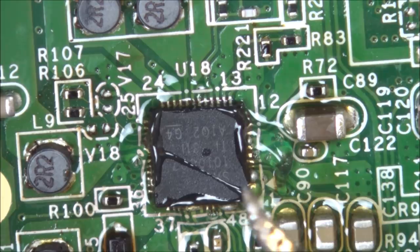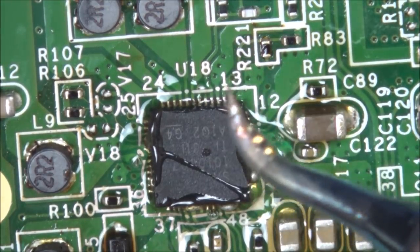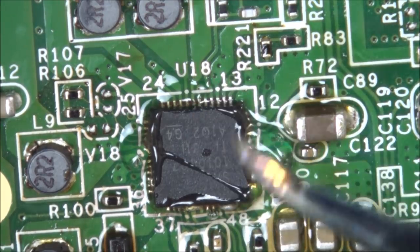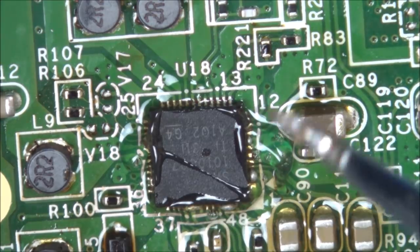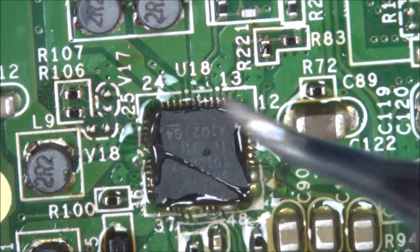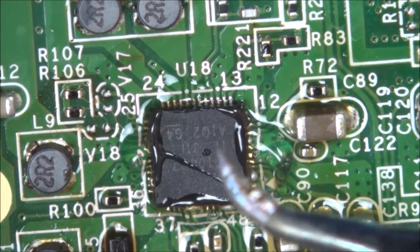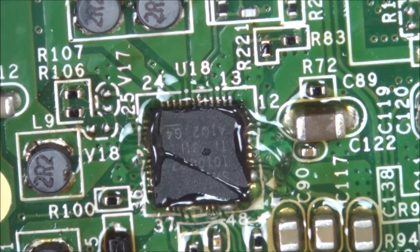Right, first things I notice are, I tried to put solder just to sort of tin this tip, and when I wipe it, I can't wipe that part away when I put it into my sponge. So maybe with this one now, I'd have to use that kind of metal ball you get that's full of wire meshy type stuff to remove the solder. Right, let's see how this is going to go now.